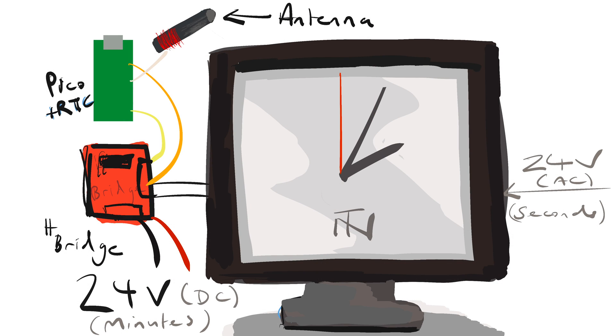A microcomputer with an internet connection would be overkill, so we've used a microcontroller listening to a radio signal instead. For a few euros, you can get a ferrite antenna that can pick up longwave radio, attach the antenna to a Raspberry Pi Pico, and we're in business.